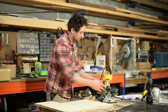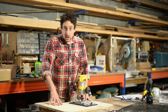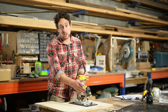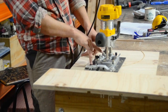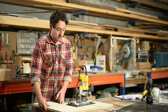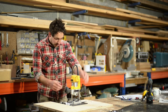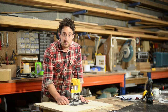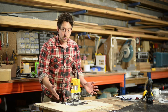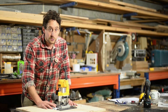This next use is dead simple. If I wanted to cut a dado in a board using an edge guide, instead of measuring the exact distance from the edge of my router bit to the edge of the router, I can just do it roughly. I know the distance between the edge of this plate and the edge of the router is about 180mm. I clamp my guide somewhere in that ballpark, put it in place, look at the line I actually need to cut, and use the micro adjustment on the base plate to get the router bit in exactly the right position — without moving the guide. It's a really small thing but I think it's really useful, and certainly in the work I do, I use it quite a lot.